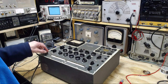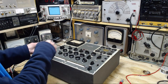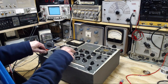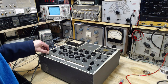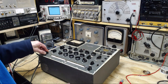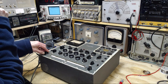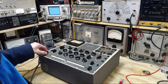So this is changing it. I doubt you can hear this in the microphone, but as I increase the line adjust control upwards, you get more and more juice coming in here. This thing hums louder and louder. Turn this right to minimum. Get almost nothing here, so that's kind of interesting. Not 100% sure what to make of that, but it might be telling us which side of this control the leaking effect is on. I don't know what to make of that.